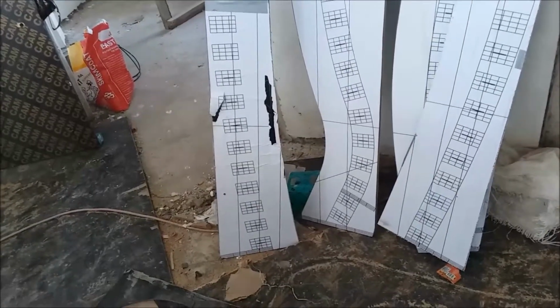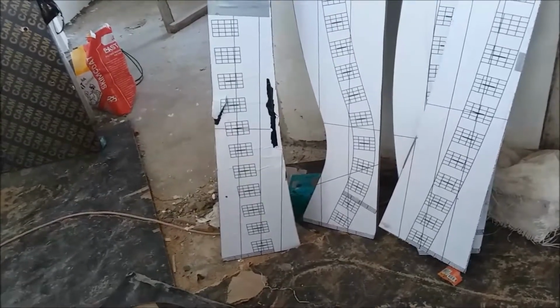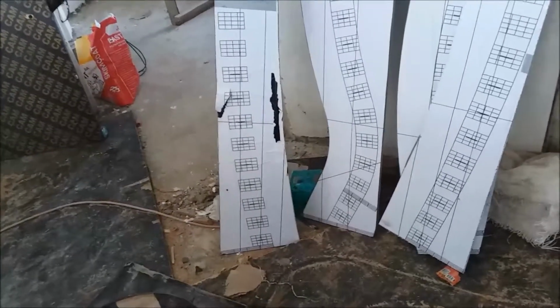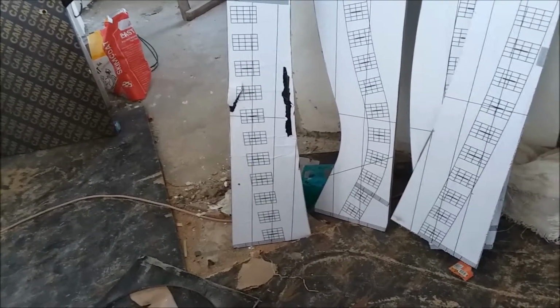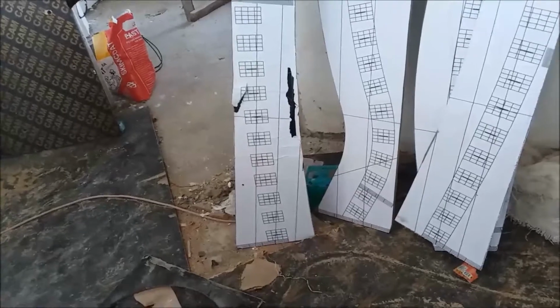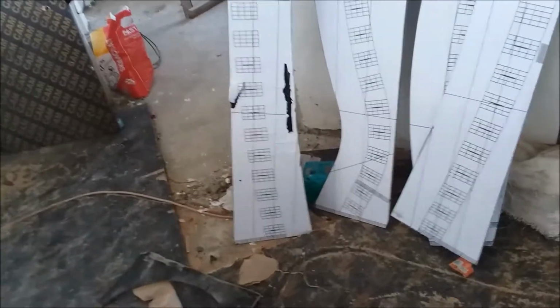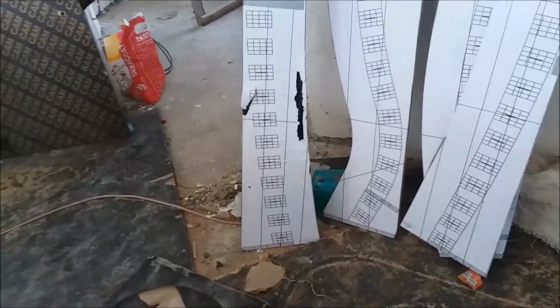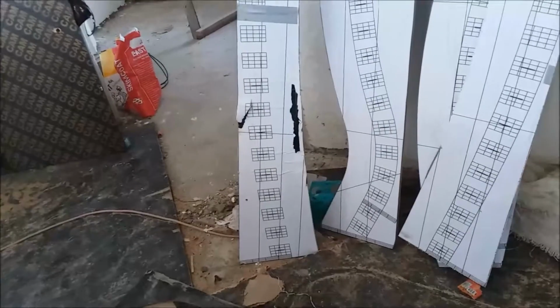And we haven't ever got around to taking the forms off when it was like 2.5 hours old, where we could blend that edge. So we just blend it with a diamond wheel on a sander. Diamond sandpaper like you use on edges of tile and stuff like that. Anywho, I'm hoping there's not a lot of wind noise on this, because this house is designed to amplify wind.